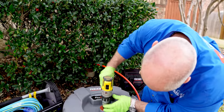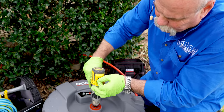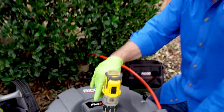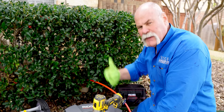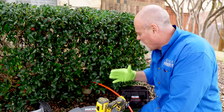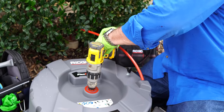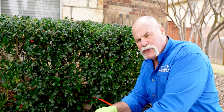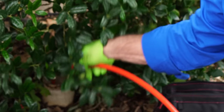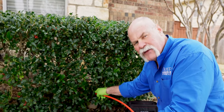On the clutch, you don't want to set it at drill. You want to set it to the strongest setting before drill, and you also want to back it up a little bit. You want that clutch to kick in — you don't want it to jam, you don't want your chains to lock up. If you keep applying pressure with it spinning, it's going to cause your cable to kink or lock up, creating undue stress you don't have to. So put the battery back in. Make sure the person controlling the drill is the same person holding and guiding the snake in and out — set everything up so one person can handle it all.